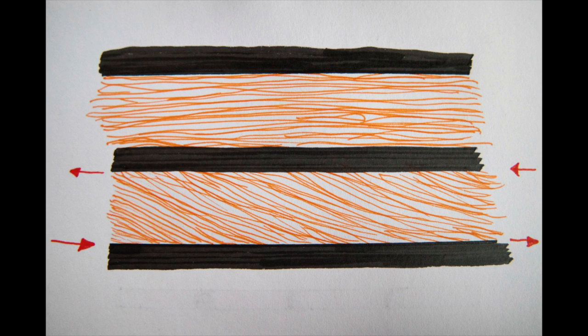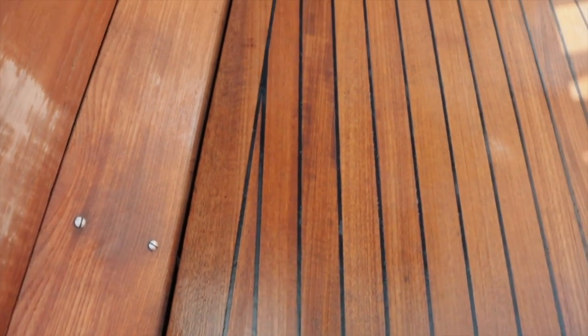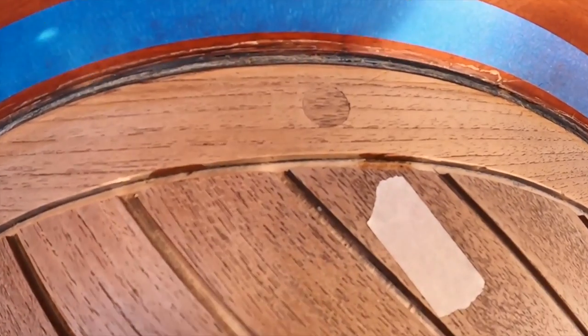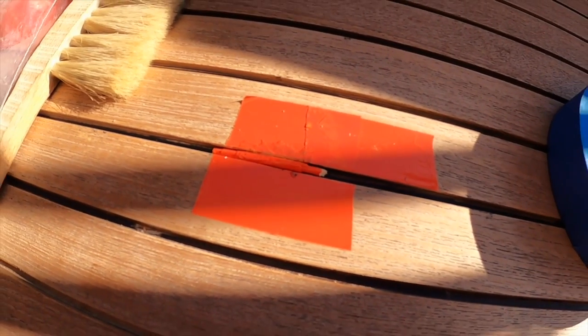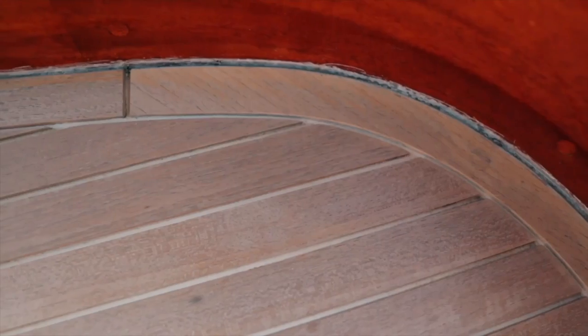The initial step is to carefully cut the seam between the old caulking and the teak planks. If possible, follow the grain of the plank to avoid cutting into it. For this, I use a sharp X-Acto knife, and I use both hands for better control. It is often hard to see what direction the grain goes, but I work slowly. If you do cut into it, you can fix it with a little bit of epoxy. The more careful you are on this step, the prettier the end result and the more longevity you give to your teak deck.